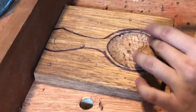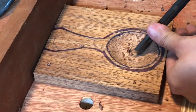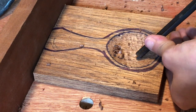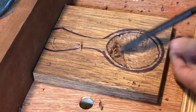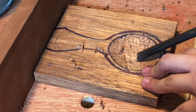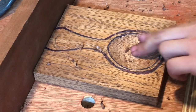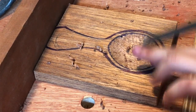I'm trying to go with a completely carved finish on the inside of this scoop, so I will not be sanding on the inside. And this is completely possible as long as you respect the grain. So say I'm going downwards this way, and I mustn't be lazy to flip it around to go downhill from the other side, or else I'm going to start getting tearout all over the place. And there'll be a sweet spot where they meet, probably at that flat surface.